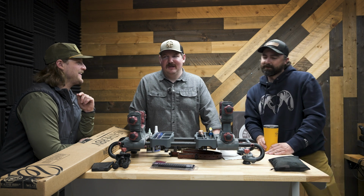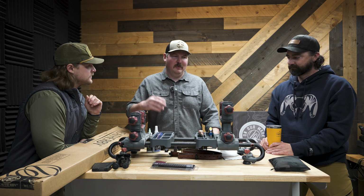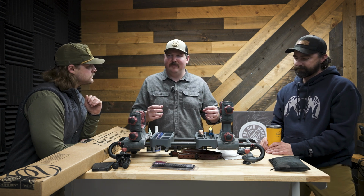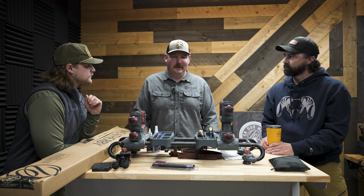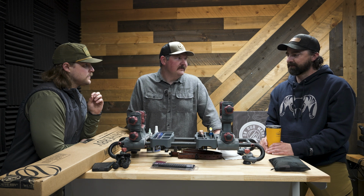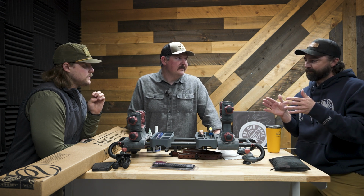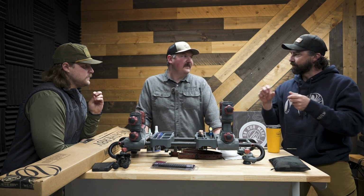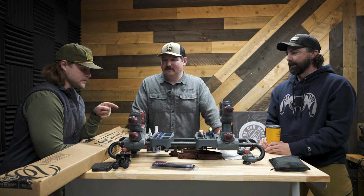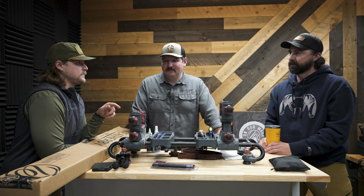Yes. Absolutely. So on the manufacturing floor, if you ever take a tour of Weatherby, almost all of them are just shop vises, and they have jaws that clamp on barrels. So that is kind of the professional way to do it. Sweet. I think on Brownells or Midway, they actually have a barrel for a 4-inch vise or 5-inch or 6-inch vise jaws. There's a little soft jaw that has a triangle cut, so it'll grab your barrel. It's pretty slick. And I think even Tipton's starting to make a ball head one that mounts to your tabletop now too, to make it a little bit easier.